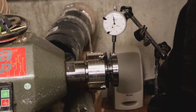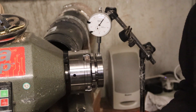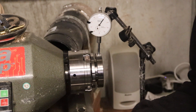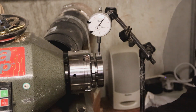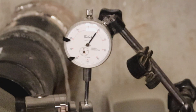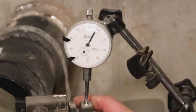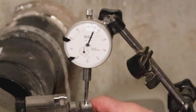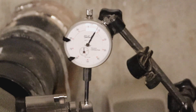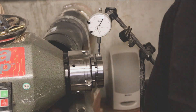Let's move on to the Nova 2 to see what the runout of that chuck is. You've already seen the Barracuda 2 and the utility chuck, and both of those were three to five mils in that neighborhood. We'll give this a spin and take a quick look. Same precision as the other two chucks — they're all in very close proximity to each other.